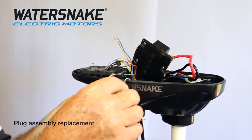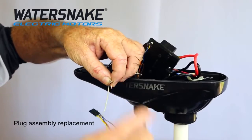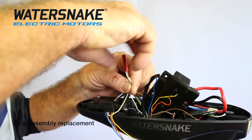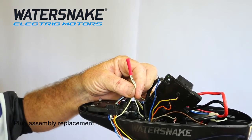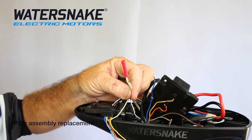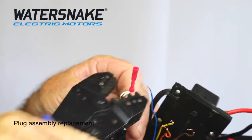Take your 2 wires, and it's only colour to colour, so just twist the wires together. Slide the crimp on. With this, your wires are twisted together, so just use the one end. The wire's much too thin for the crimps to put in either end, so much better off twisted together like that. Crimp each one individually.